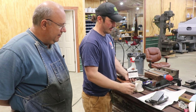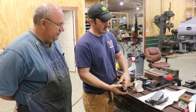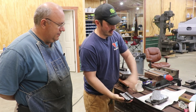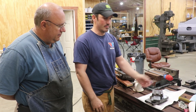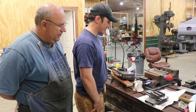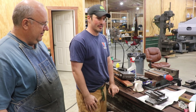There is a gib — it's on that side piece. Then I went into this one, which is interesting because I have two bearing surfaces — it bears here and it bears here. Once you get started, you just keep scraping, blue that to that, and make them all match. Not perfect, but it's working. You can make it perfect — just keep scraping. It's a great class, a lot of great resources here.